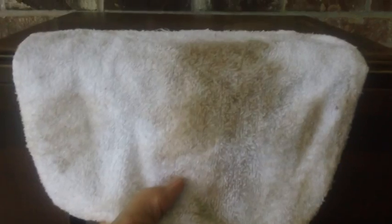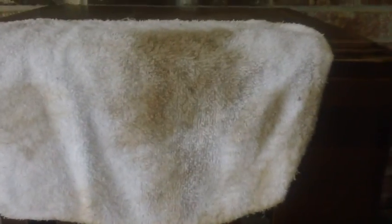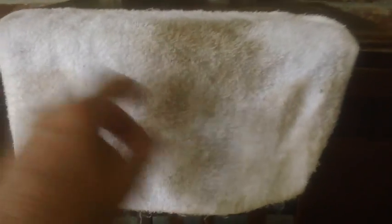After the third time going over it, it came out pretty darn good. What you see right there is just a little bit of finish that came off — the lacquer-toned finish. I think they took some stain, threw it in some lacquer, and sprayed. Anyway, there's no dirt, no grime — just a little bit of finish. We'll consider that clean. Now the top is just not going to be salvageable with Howard's Restore Finish alone — it's going to have to be stripped down.